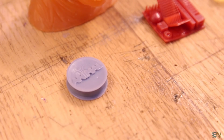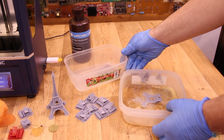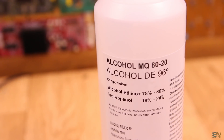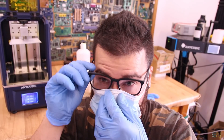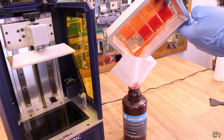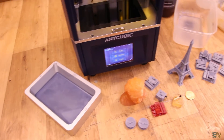Finally, I also printed an ear plug, but this has nothing special. Printing with a resin DLP printer is quite messy — you end up with plastic containers with alcohol and resin, latex gloves, resin filters, and putting back the leftover liquid into the bottle. Also have in mind that this resin is toxic, so you can't really throw the residues just anywhere.